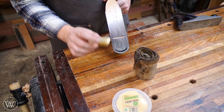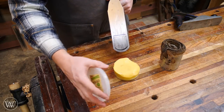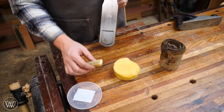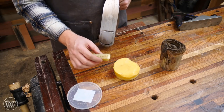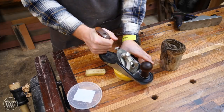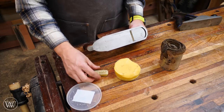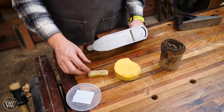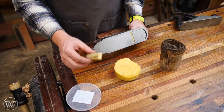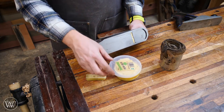This is a method I switched to a while after using the can, but I really kind of like something in between. That's where I've started using this — a block of thick paste wax. I have a video on making this where I basically melt down beeswax and add in an oil, so I kind of get the best of both worlds. I can grab the plane, slide it across, and we're impregnated and ready to go. It's just as quick as that, but I get the thicker coating of the beeswax that evenly coats across the sole. This lasts a lot longer than the oil, is easy to apply, and works as well as the beeswax without the thick clumping. I just have to make sure I keep a lid on it occasionally to keep any dust or wood grains out of there.